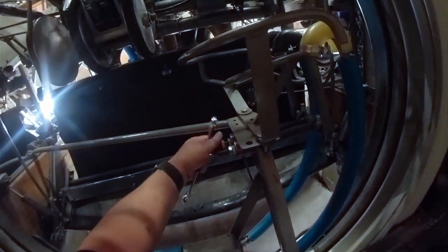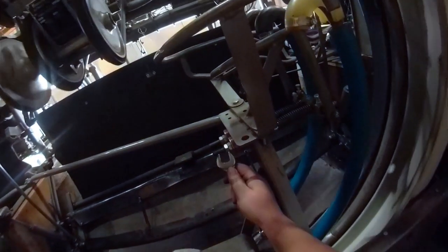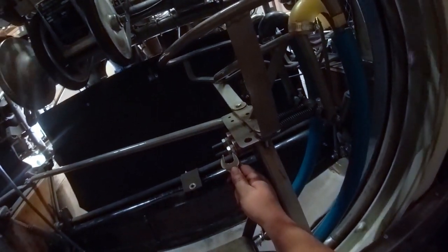Now, a little bit of play isn't going to hurt. But when you're out that far, that's when you put too much pressure on your lift rods. These ones still have the old springs on it, thankfully. And you can see that they're much more evenly pressured now. We're going to watch for how that ball goes right over the top.